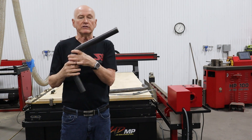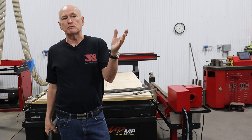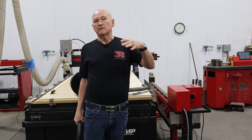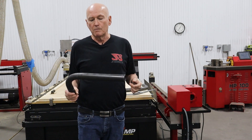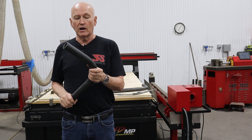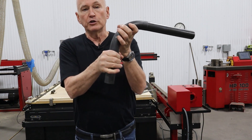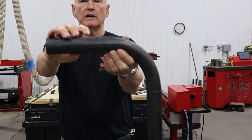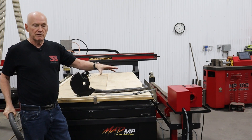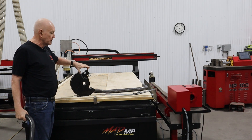The general idea of template bending is to take a piece of tubing and bend it 90 degrees. You need to do this for every size, thickness, and kind of metal you're bending because you'll have different spring backs. Chromoly has a little more spring back than DOM, and DOM has a little more than welded seam. What I do is take a conduit cutter, run it around the tube before the bend to put a permanent mark in it, then load it into the bender with that straight-edge mark at the saw-cut edge of the die.